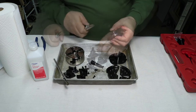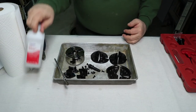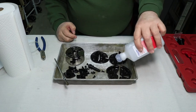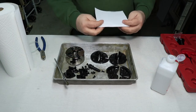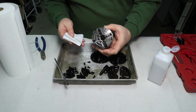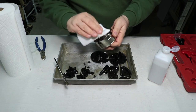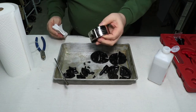The jaws are numbered one through four so you can line them up correctly when putting them on the chuck. I'll put some rubbing alcohol on the parts and start wiping them down. For the main chuck part I'll use a paper towel soaked in rubbing alcohol - it might be a good idea to wear latex gloves - just cleaning it off without getting any solvent inside where we want the grease to stay.